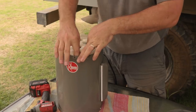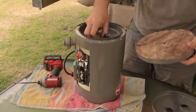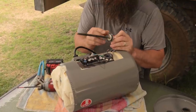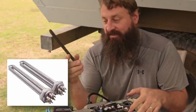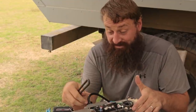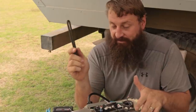First thing to do with a water heater like this is to tear it all to pieces. There is the original 110-volt water heater element. This one is stamped 1440 watts. Now I am aware they do make 12-volt water heater elements like this — 400, 600, and 800-watt variations — but I could not find one that they would ship to Mexico at this time. So I can always do this upgrade later. If we find we never use 110 and we want the option to heat her up faster, I can get a 12-volt version of this water heater element. But for now we're leaving it 110.